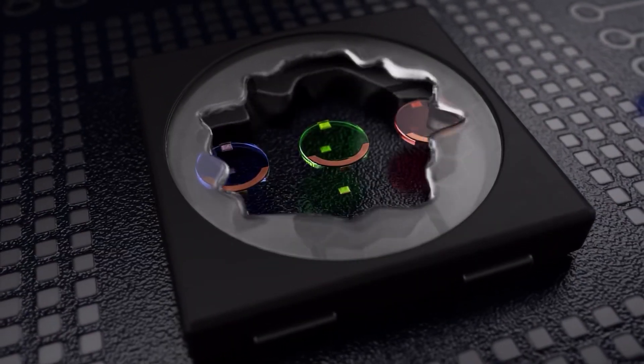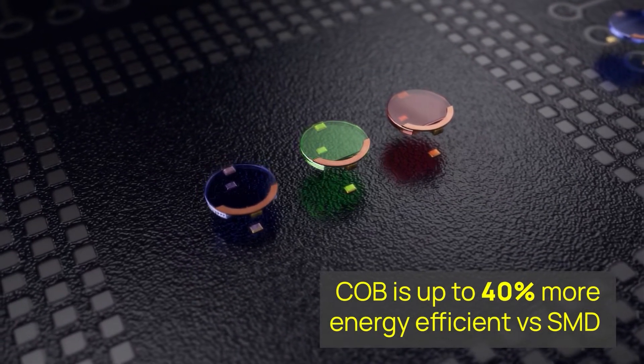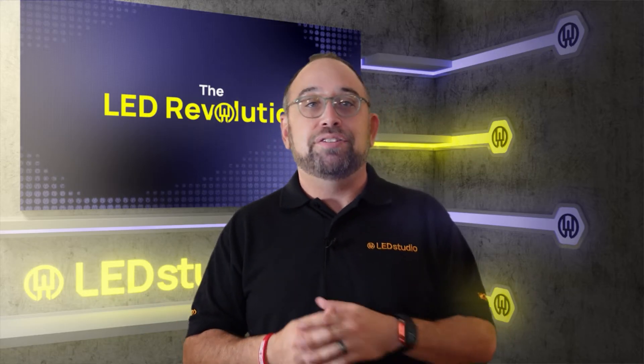Finally, we have COB or micro-LED displays. These diodes are a fraction of the size of SMDs, down to 0.1mm on a side, and have just as much technology packed into them. Instead of being soldered to the circuit board, they're embedded in the substrate of the circuit board. This increases black space in between the diodes, and the barely visible diodes themselves create stunning image quality. COB displays are also typically used in conjunction with a GOB coating and are frequently used in a flip chip configuration, giving you a top-of-the-line experience and best-in-class image.